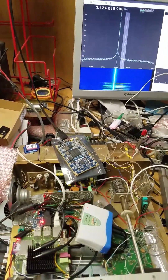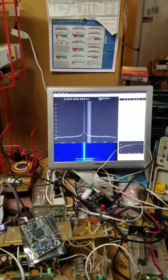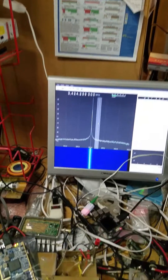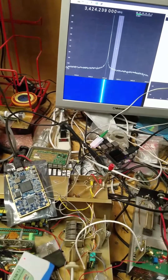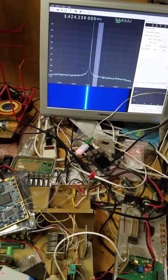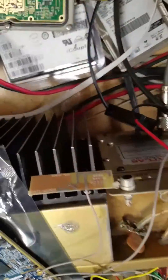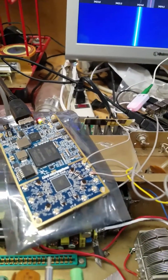And of course in the case of the LimeSDR, get some shielding and whatnot, but it lends itself a little bit more to either it's picking up a harmonic off of this, or the harmonic of the local oscillator of the LimeSDR. I'd tend to believe it's most likely a harmonic of the local oscillator of the LimeSDR, even though I've got the wrong antenna on it — I don't have an antenna for 2.5 GHz, and I think 5.8 — basically it's a Wi-Fi antenna.